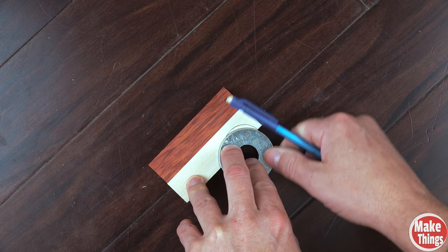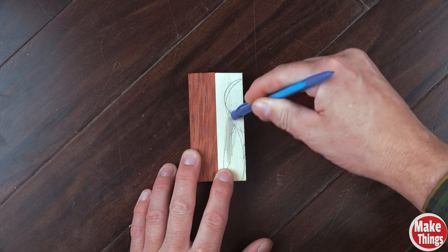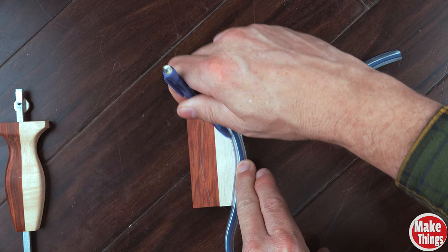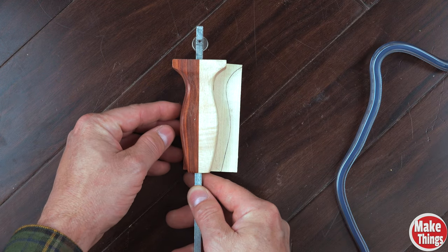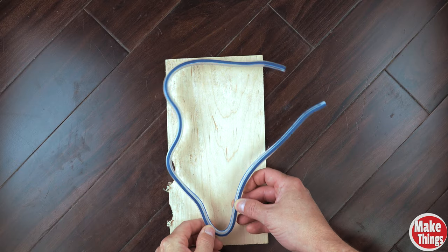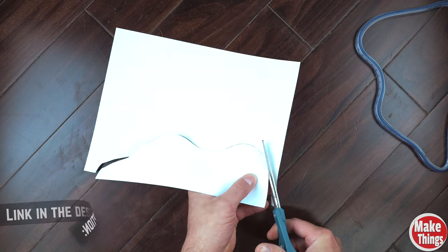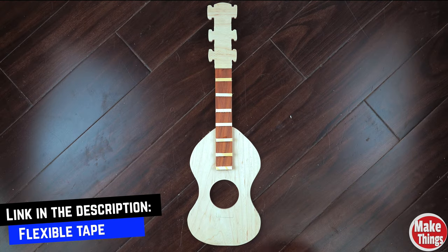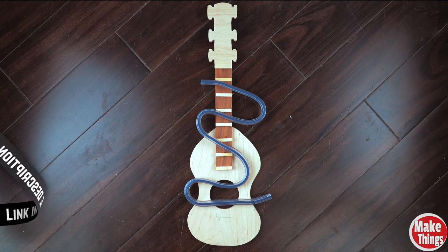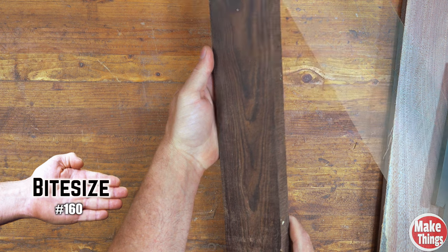Take this marking gauge I made a couple of weeks ago — before I went with the final design I had all sorts of circles that I had created. The problem with adding graphite through the creative process is how messy it becomes: you'll either do a lot of erasing or use denatured alcohol and wait for it to evaporate. But with this flexible ruler I'm not leaving any marks until I get the design I'm looking for. The only drawback is that it's hard to flip it to get symmetrical sides, but after I get the shape I like, I can transfer it to the edge of a piece of paper, cut it, and use it as a template.